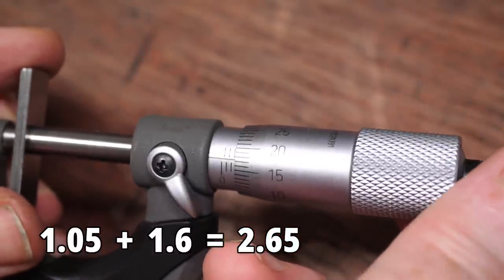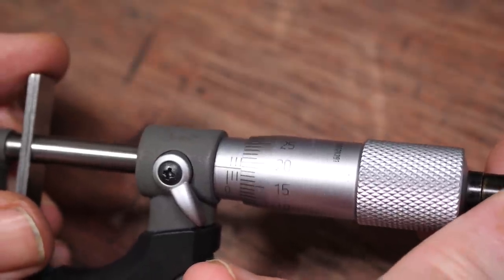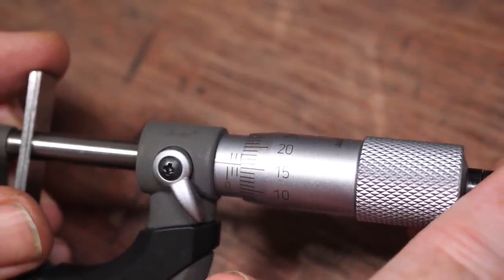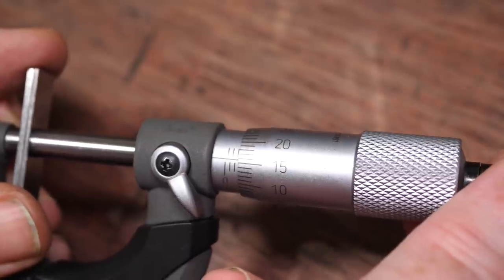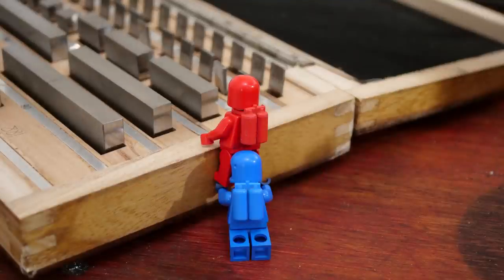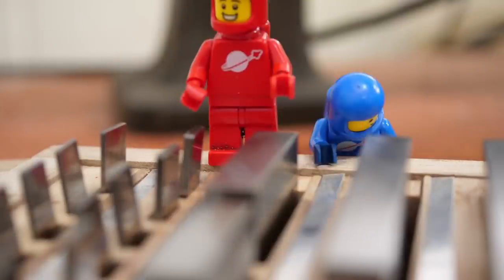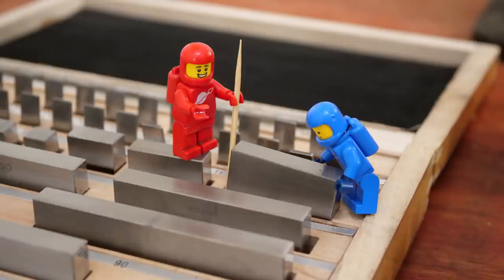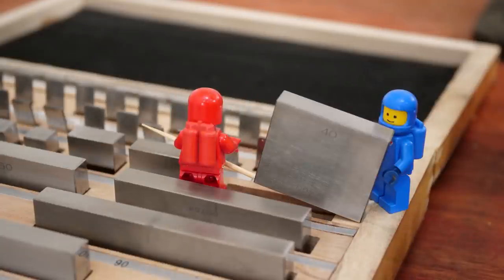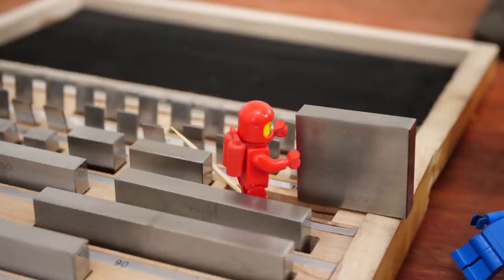Learning how to use gauge blocks has been fun, and they've been really useful for getting a better idea of how much the lathe needs to be adjusted. Thanks very much to Banggood for sending me this set for free. If you'd like to support my channel and help make more videos like this, the Banggood link in the description will give me a small reward if you use it to buy. The next step will be deciding how to make the adjustment — whether by adding material to one side or taking it off the other. I think there are some advantages to adding material in the form of fixed shims, but if you have any experience with this kind of change, I'd like to hear about it. The next video will be more work on this lathe, so keep watching.